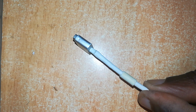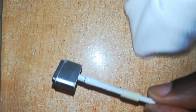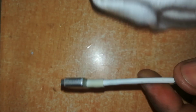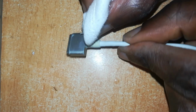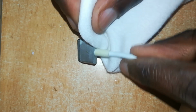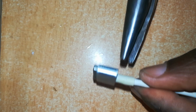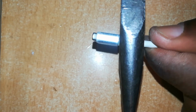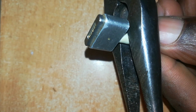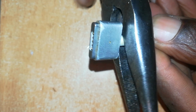Then let's slide this insulation over the joint quickly. Of course, don't touch the glue with your fingers. And here we are. Wipe off excess glue. While it's setting, you can do all the small and minor adjustments. It's basically to make this joint as round as possible so that it doesn't look any different from one which has not been repaired.